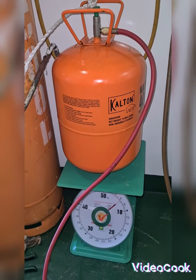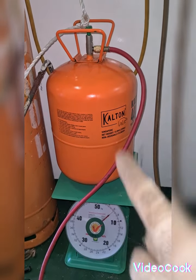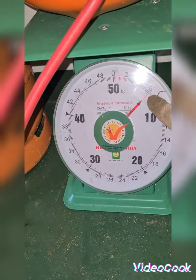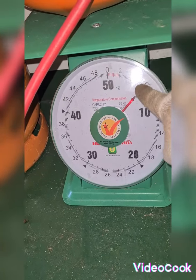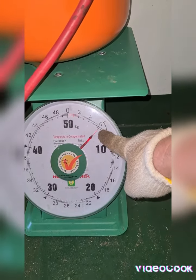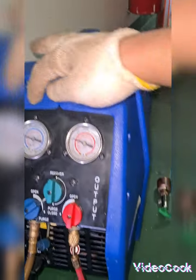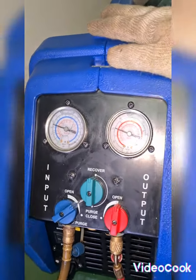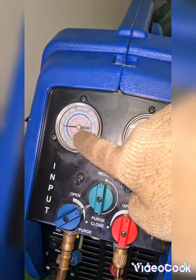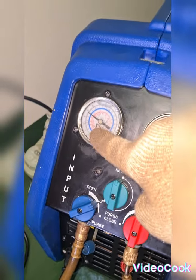While I'm charging — refilling refrigerant into the empty tank — the weight is getting heavier. Before it had an initial of 5.2kg, now I have 6.2kg. The inlet gauge of my recovery pump is jumping from 2 bar to 4 bar, 2 bar to 4 bar.